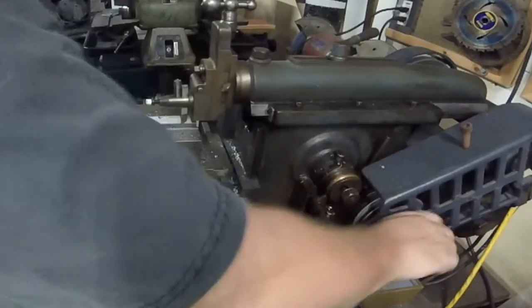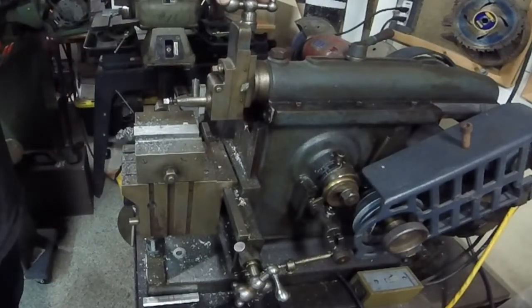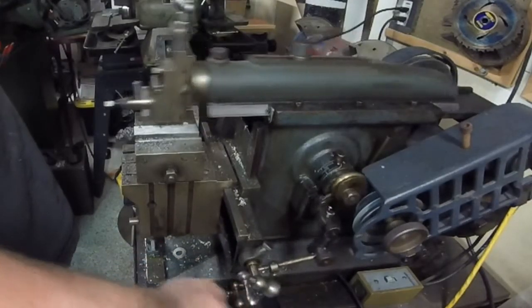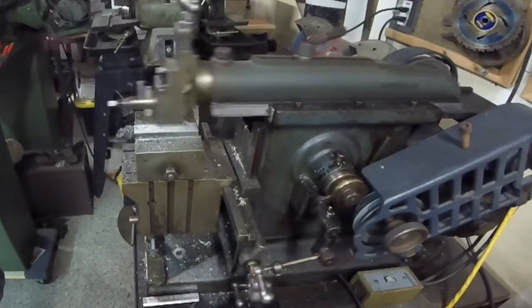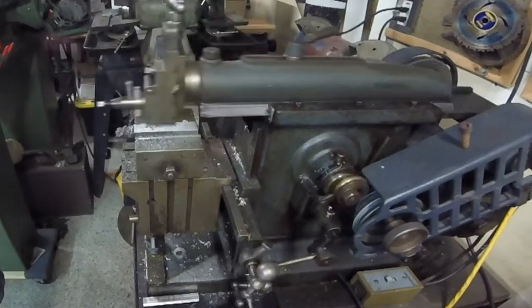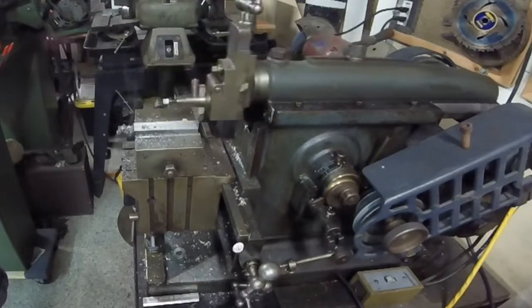I'll give you guys the e-ticket right here. We'll go ahead and make one more pass. We're going to come down another 10 thousandths — let's go 15. I think I'm at about the limit here as far as the depth of cut on this one. Getting a little bit of resistance in it. It's not horrible, but I can see the box moving around a little bit more than I wanted to.